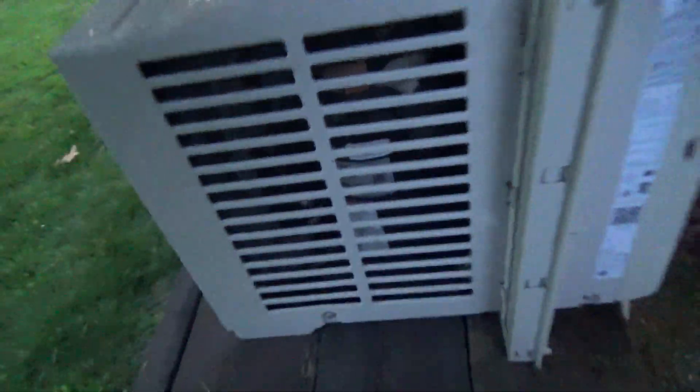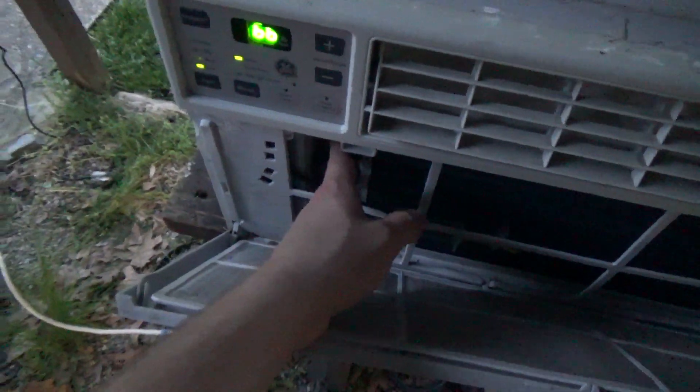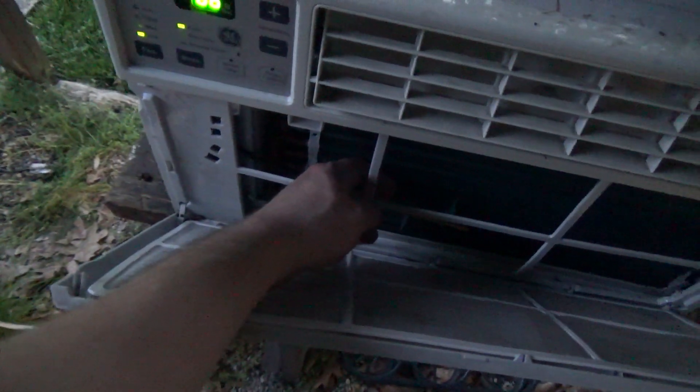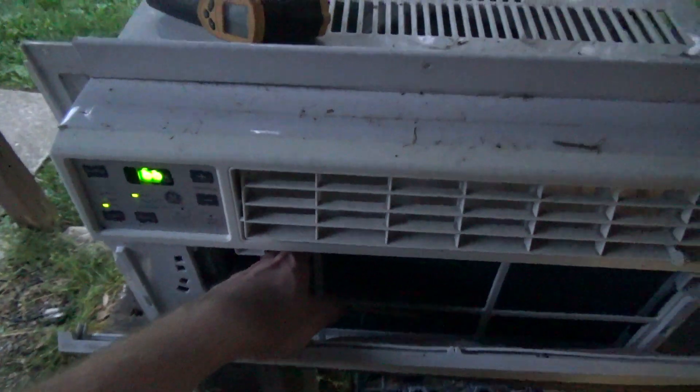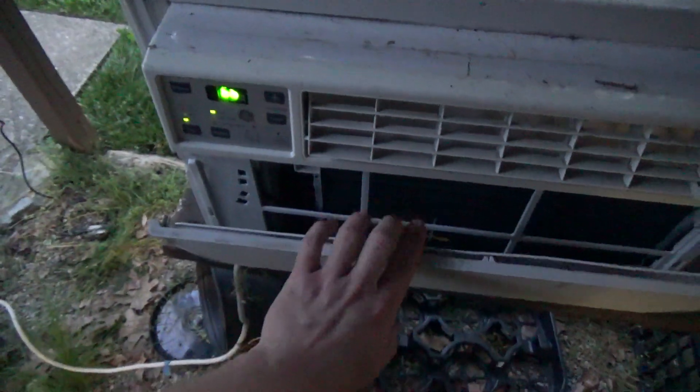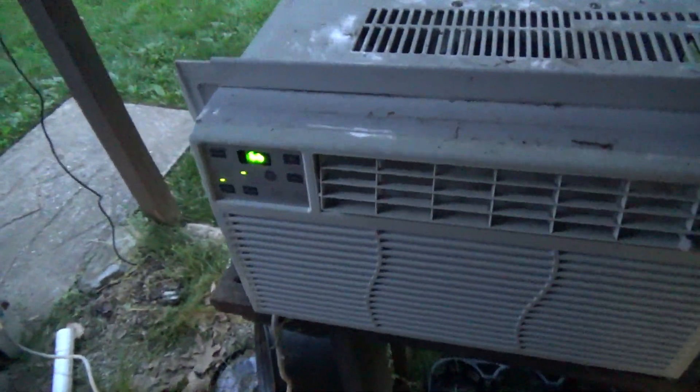The return line is not sweating — no sweat on there. It just sounds awful, like it did before. The coil is not cold. It's cold on a couple of runs where it first comes in — those two runs are cold and sweating — but the rest is just not cold. So 25 minutes of operation at 66 degrees and it's not getting the coil down to temperature. It's not even giving a delta 10. I think the thing is just a piece of junk or it's busted.